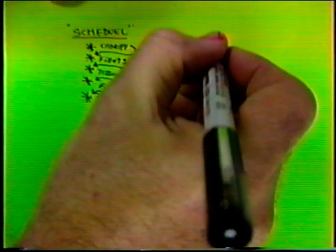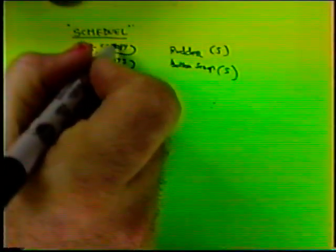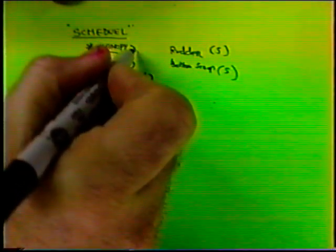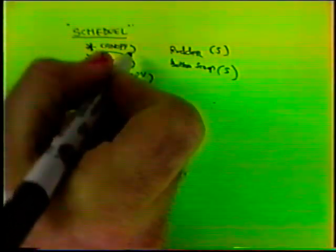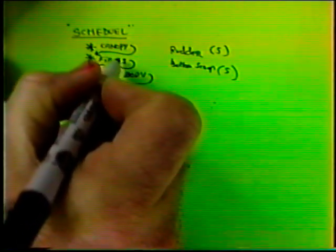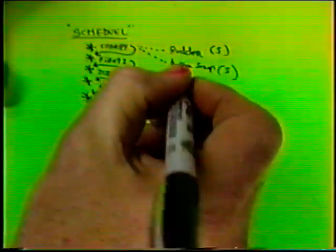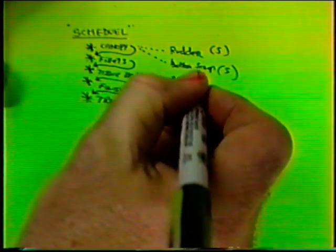I can put these in, bring these up to silver. So what will happen is I'll get a certain amount of work done on a canopy, and let's say I only have a half hour left in the session. I know I don't want to start the fillets. I don't want to be in the middle of doing something and end the session. So what I can do, I can transition over here, work on the rudder, work on the bottom scoop, get that into silver. I can prime the cowl. Now the cowl, because it's fiberglass, all that's going to need is a couple coats of auto primer and paint, and then silver.